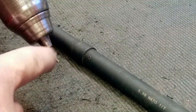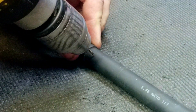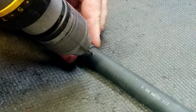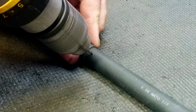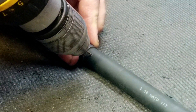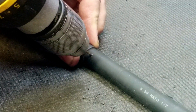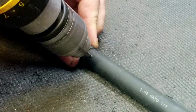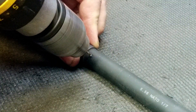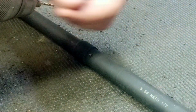I have a 5/64th drill bit right here. I've got a little bit of oil — you always want to oil up every time you're going to be using a drill bit. We've got the gas port hole right here, and you just want to start in nice and slow, come out, start in cutting a little bit more, come out — you're always cleaning out the hole by doing that. Always be cleaning out your chips, just like that.